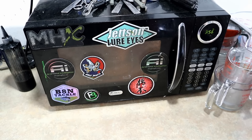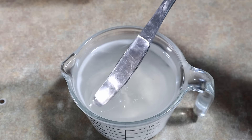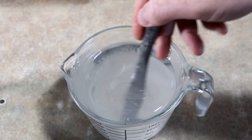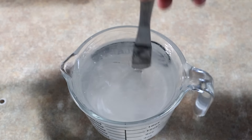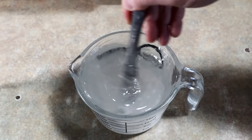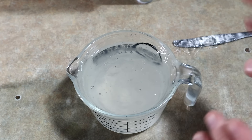That was four minutes and we are still largely in gel phase. But wow, look at the clarity — very, very clear. Nice thick gel phase so far, really no bubbles, which is good. You'd always expect pretty clean plastic when it's new and hasn't been beaten up by moisture exposure. This is looking exactly like we want it to, but it's still very much in gel phase so we definitely need a little bit longer cook time.